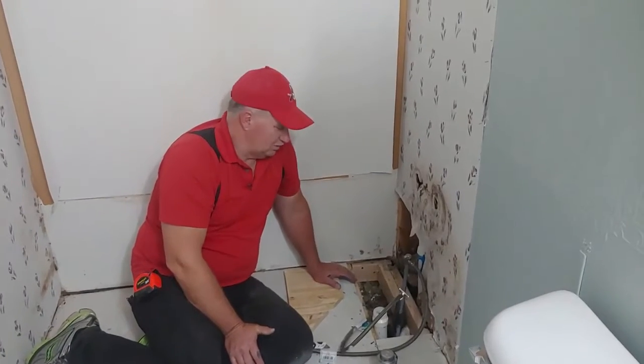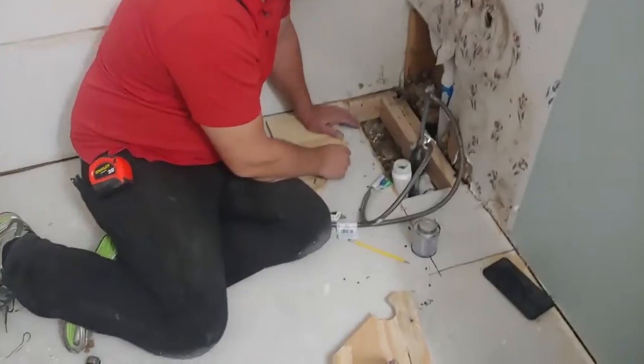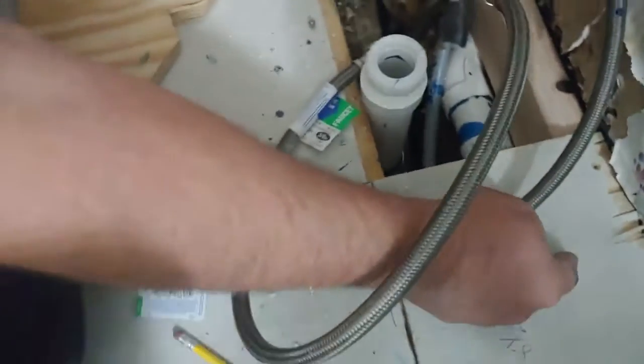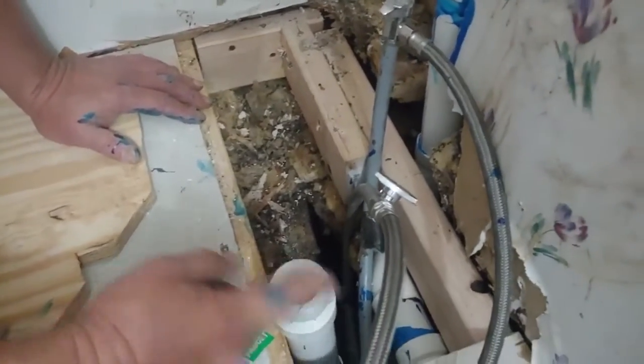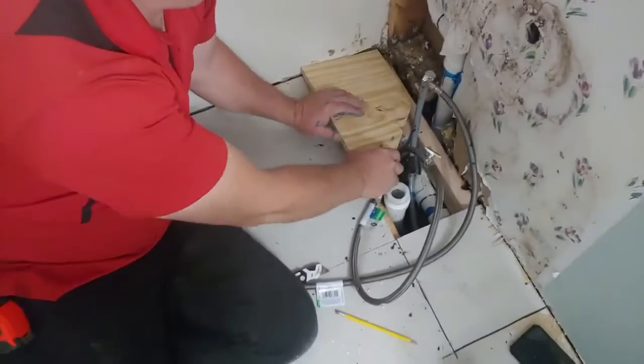Here, we're going. All right. Look over here and we'll show them all the plumbing that we did in here. The vent was hanging out in the floor. We had to get that in the wall. So we cut into 2-inch, put an adapter, put a T, ran the trap where it needs to be, in theory, right here. And then the vent has to go back up through the wall. And we've done all that, and we've repositioned the lines so they're inside.